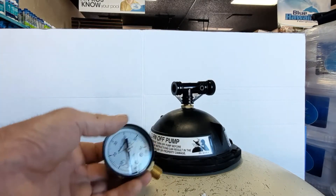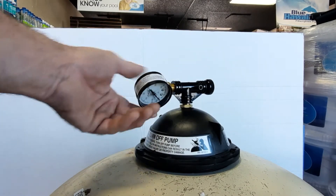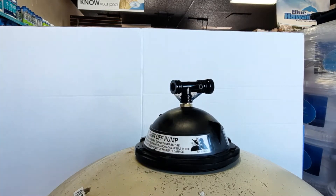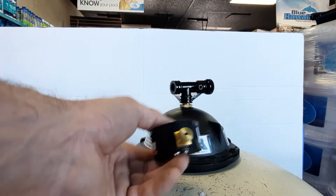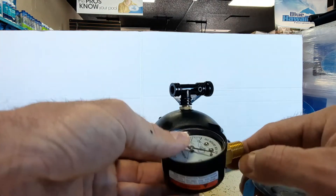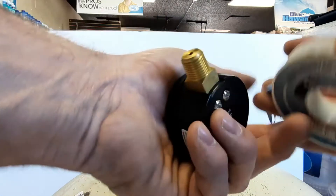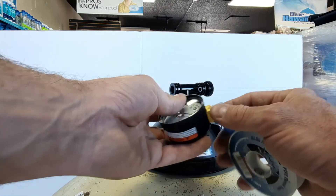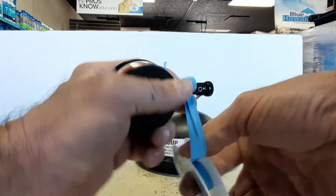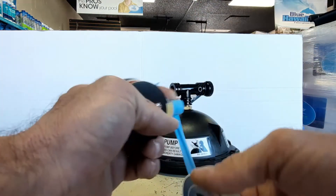With your new pressure gauge, screwing them in tight will often cause a leak, so instead I put two wraps of Teflon tape on the threads. With the threads facing you, always run the tape clockwise — that way when you thread it in, the overlapping end drags instead of bunching up. Make sure you don't cover the end of the pressure gauge, as that's where it reads water pressure.